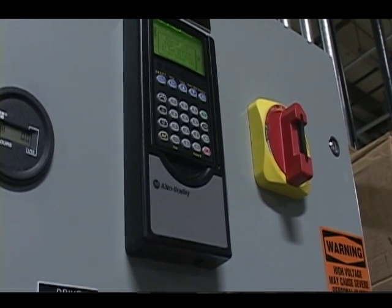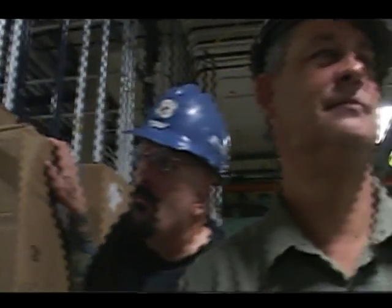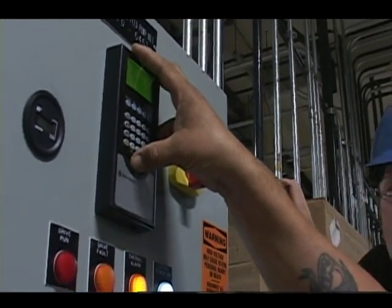Okay. Not allowed. Anybody have an idea why it's not allowed? It's in auto. It's where the speed's coming from. So even though I'm in auto, you're right, because this is being used as a control source, it will not let me remove it without generating a fault. So even though I tried, the drive is smart enough to know.